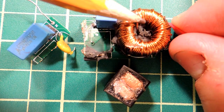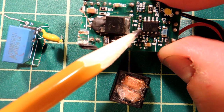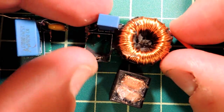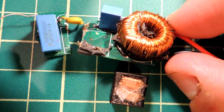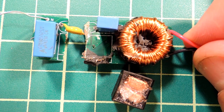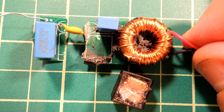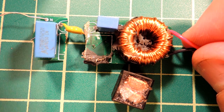The large toroid here is the transformer — looks like a nice isolated power supply design. If I flip it over, you can see a MOSFET and the associated switcher. Nothing too shocking about the design, pretty straightforward. There is one real big omission: you can't see a lot of filtering on the DC side, which means the DC has a lot of pulsing that goes along with it, and that turns into flicker. Some people are very sensitive to that and can really notice a bulb that flickers. We saw that also when taking photographs during those teardown portions of the video — the camera is recording those bands, which is flicker as well.